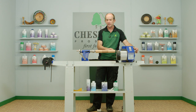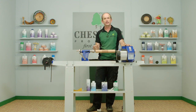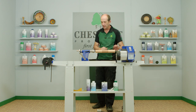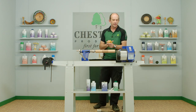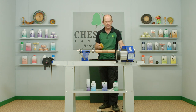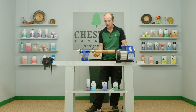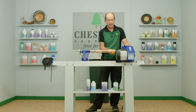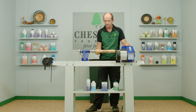So that's the acrylic sanding sealer dry, ready to sand back in preparation for putting the next coat on it. As I said, in this case, we'd probably use the acrylic lacquer in the brushing form, but we could put one of the waxes or the friction polish over the top of that quite happily. Important not to use something like the melamine lacquer because that will attack the acrylic sanding sealer. They're just not compatible. So as normal, using the last abrasive that we used on the timber, in this case, the orange Nyweb. So just a quick cut back. No real effort involved, sands very easily.